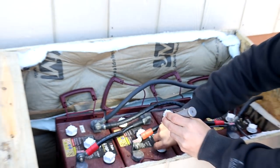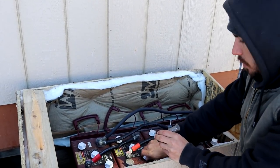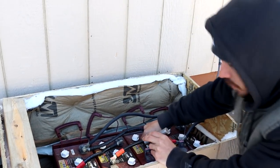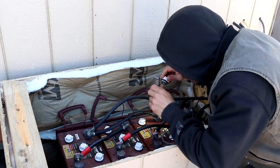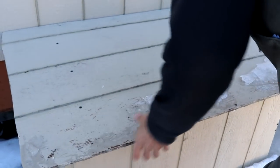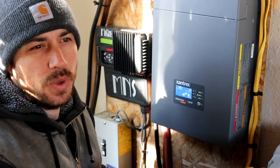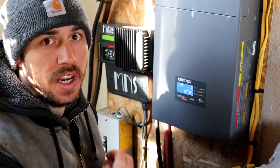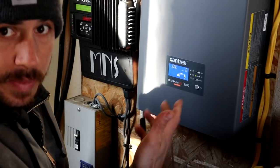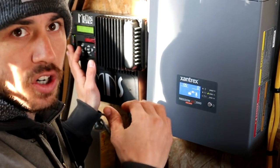This one's looking good too. One thing we were worried about when we first put in our solar system was having these batteries outside. They're in an insulated box, but it doesn't really help too much. These batteries get really cold — we have temperatures as low as negative 30 degrees Fahrenheit. We've found that as long as we keep these batteries charged, whether that means running the generator a lot during winter, we've never had any problem with these freezing. All the batteries are good — these don't need any water. We're going to head inside and do some work on the inverter, where we're going to be equalizing our batteries. What equalizing the battery means is we're going to charge the batteries really high for a short amount of time, and that's going to remix the acid and water that's inside the batteries.